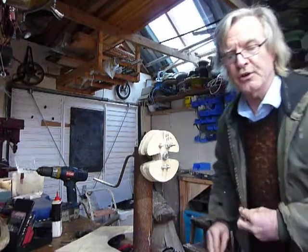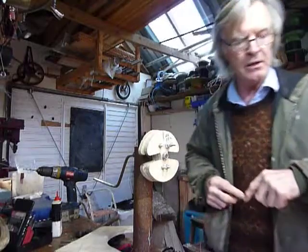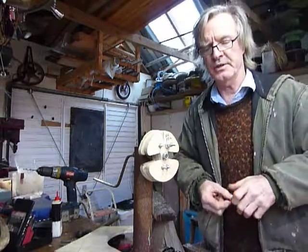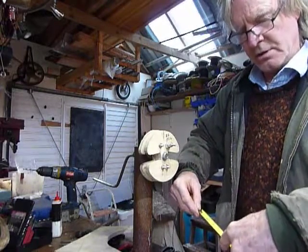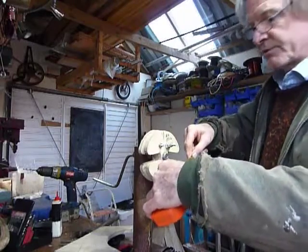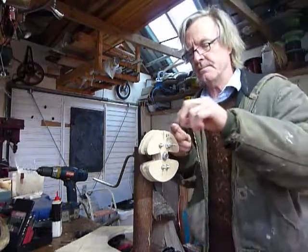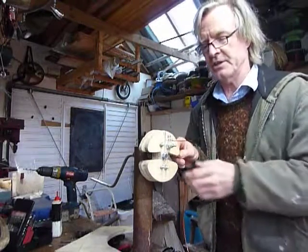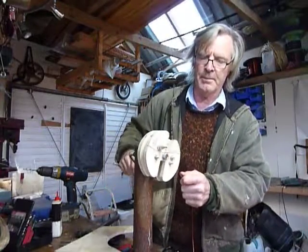I've got a spool of wire on the floor and it's just coming off the side of the spool in a lazy spiral — that works well. There's less inertia that way than putting the spool on an axle if it's a big spool. So now I'm going to use about 15cm of tail here, put a 90-degree bend in that, and tuck it into this little saw cut at the top and have it simply sticking out like that.